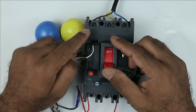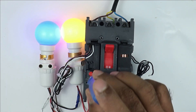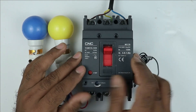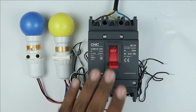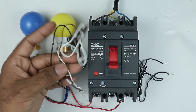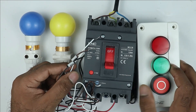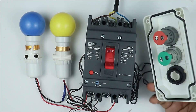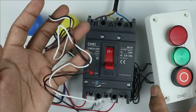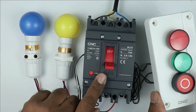After mounting, just turn on the MCCB and press the tripping button to check tripping. If everything is normal, place the cover back at its position. Now for this MCCB breaker, first the wires of the auxiliary contact have to be connected. For this I am using two indication lamps. First open the lamp housing, and at this red indication, the phase supply is to be provided from one of these wires. The red indication must glow when MCCB turns to ON condition.